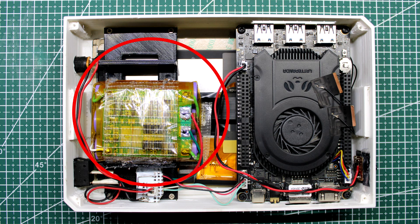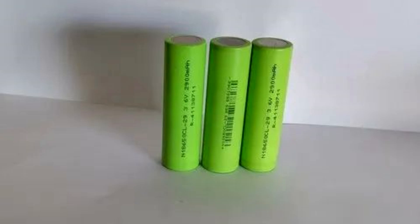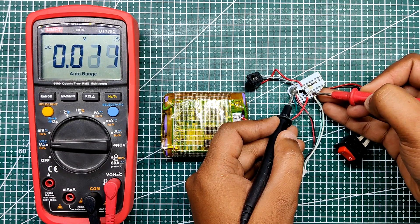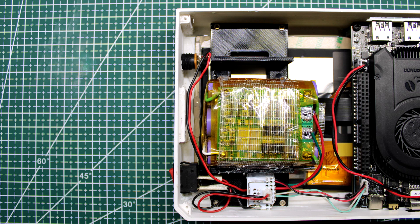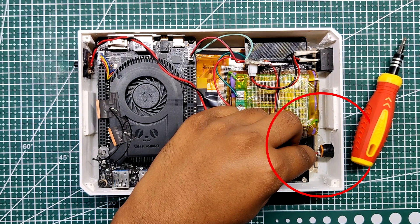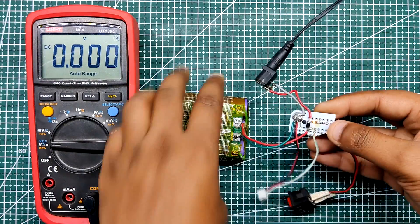We use a 12-volt battery pack consisting of three lithium-ion cells, each rated at 3.7 volts, connected in series with a BMS that controls the charge and discharge cycle. Each cell has a capacity of 2900 milliamp-hours, making this an 11.1V 2900mAh pack. After full charge it can reach up to 12.6 volts, which is within the LattePanda power input threshold. For charging, an external DC jack is connected to the battery pack's positive port with an M7 diode in series, and an LED indicator with a resistor is added to indicate when the charger is plugged in.